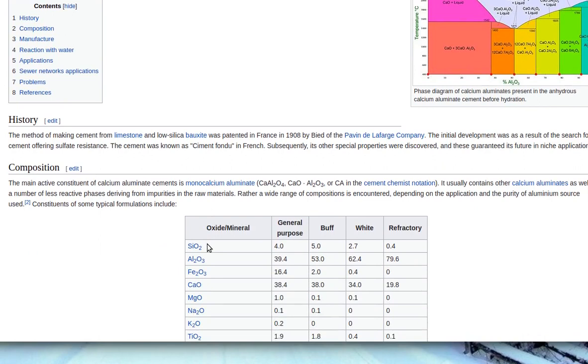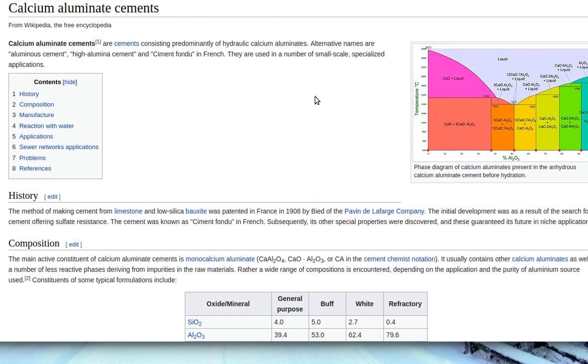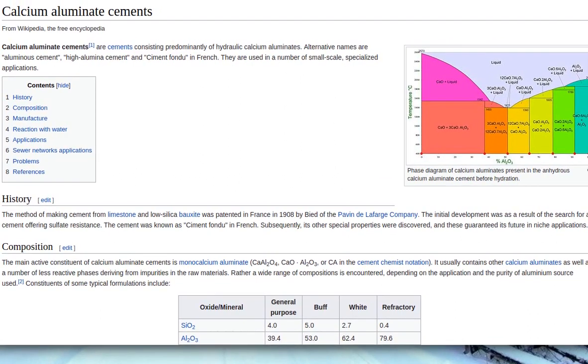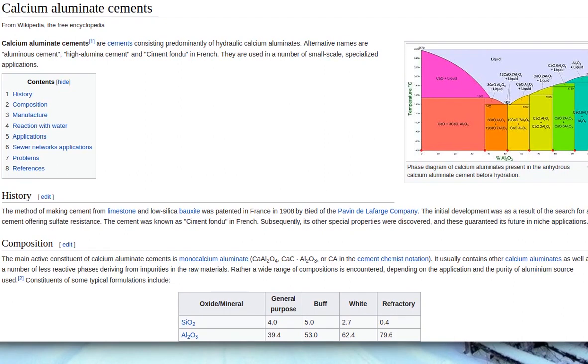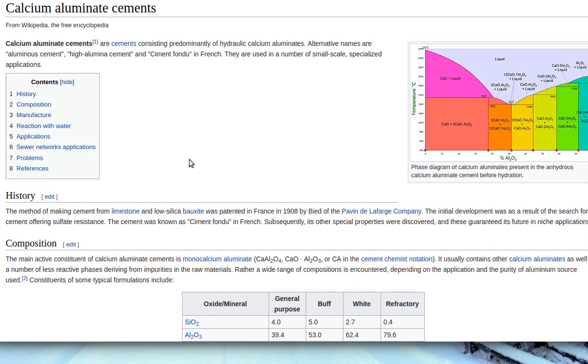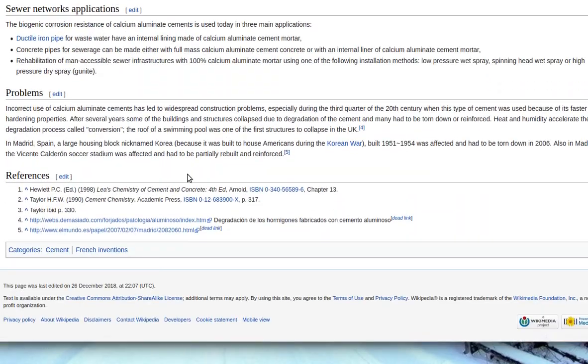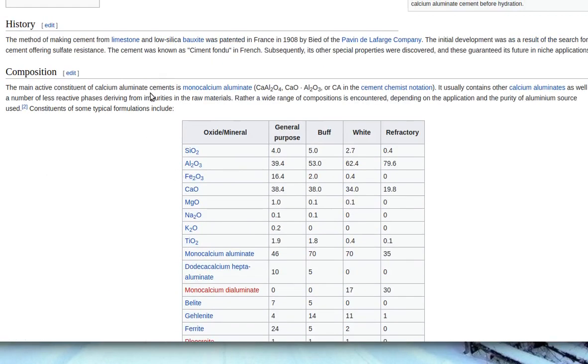So the idea is to make super precise molds that are milled from calcium aluminate cements, and then pour metal or whatever material you're using into that. One of the strengths is you can pour all kinds of stuff into that mold — plastic, metal, even rubber and foam — getting different accuracies depending on the material. Does it work with aluminum? Yeah, it's very quick with aluminum. Calcium aluminate cements handle low temperatures involved in aluminum casting, but they also handle high temperatures involved in steel casting, and they're used for that purpose in a process called block casting.